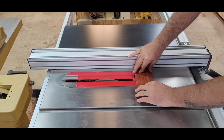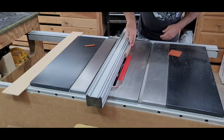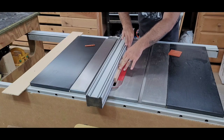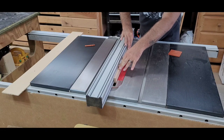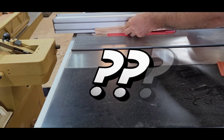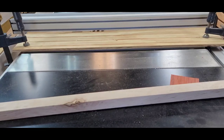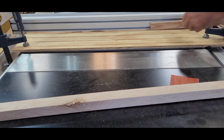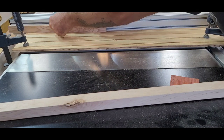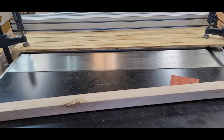Here I'm just cutting the Padauk for the joints. It's not really important to the joint - it just gives that added effect. The strips that I use for the side are half inch, and the slot in my plate is about a sixteenth over a half inch. As you can see, cutting dados right down the center is a problem, so I had to improvise. I made a zero clearance insert by clamping on a piece of quarter inch panel and bead to my table top, which worked very well.